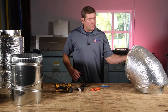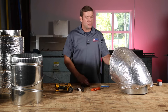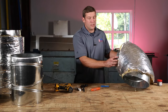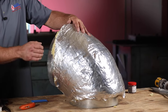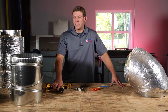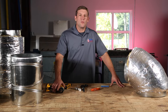This is an elbow I pulled off my shelf that had already been insulated — there's nothing wrong with it, but I wouldn't do it this way. I'd never insulate an elbow before it's connected, for a number of reasons. One, you're going to have to make a connection here and seal it. Two, you still have an angle that needs to be filled, so you're still doing a lot of the work later. My method takes more prep work in an attic versus on the floor, but in the end you'll see why it benefits.